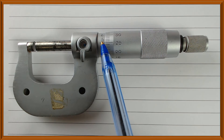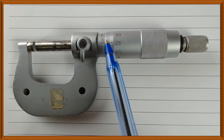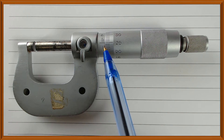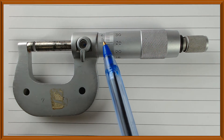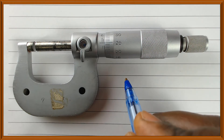On the sleeve, we can see 0 and 1, but we can't see 2. On the lower side, we can see 1.5 because the 0.5 division mark is visible. So on the sleeve scale, we can see 1.5 millimeters, meaning we are sure the reading is between 1.5 and 2. So we write down the smaller value: 1.5.